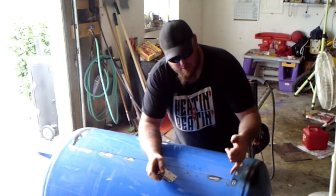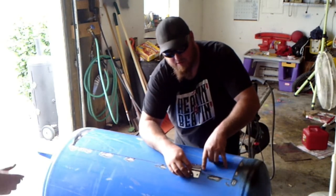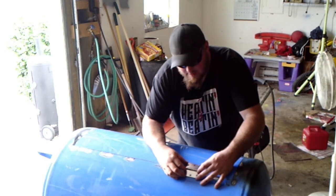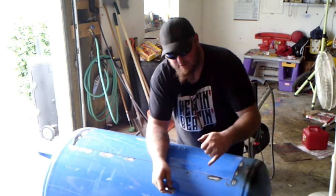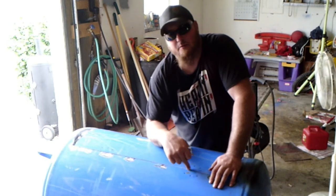So we're just going to go in from the edge, 6 inches in to the edge of our hinge on both sides, and I've already got them marked out and put it in place, get the middle of the hinge lined up. Circle with your Sharpie, and then go over with your spring-loaded center punch and whack the middle of all of those. And we're going to drill these out,